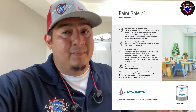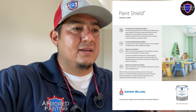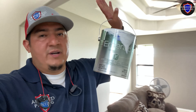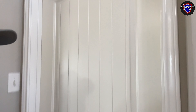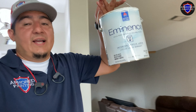There are paints that kill bacteria — not just mold and mildew, but paints that actually destroy bacteria within two hours upon contact on the surface. On this trim we use the Emerald Trim Enamel by Sherwin-Williams. It's a beautiful and gorgeous product. When you're doing door frames, it's self-leveling, so you can't even see the brush marks.